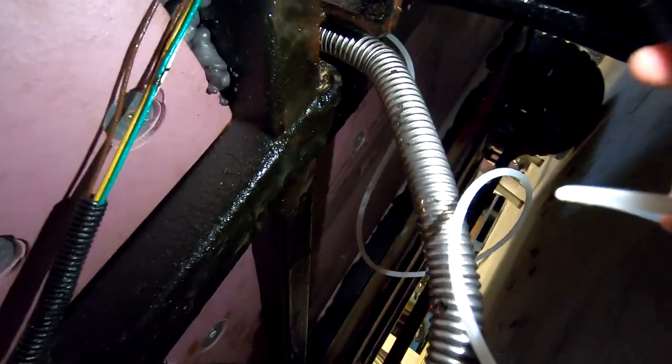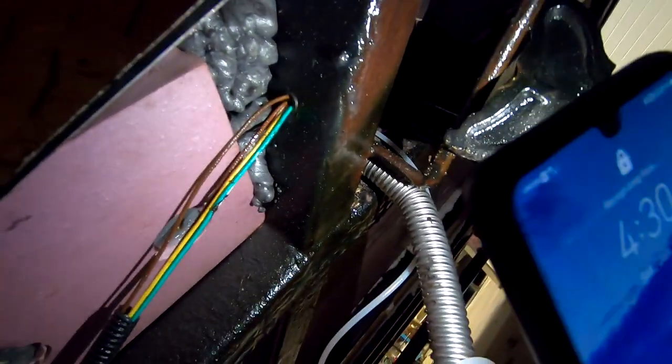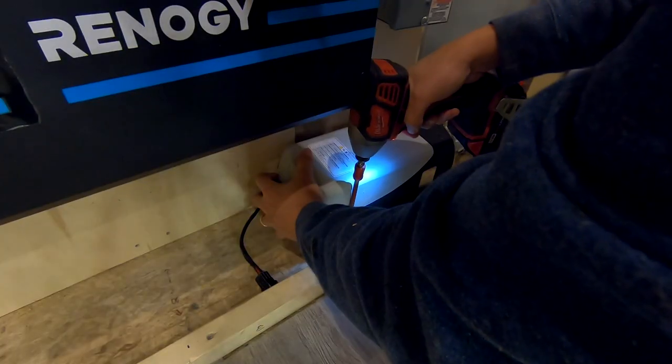Nice in there, and so the exhaust is gonna come out to the left, the air inlet's gonna go to the right, and the fuel line's gonna go to the front here where the fuel tank's gonna be mounted. So I'm gonna secure the diesel heater to the floor now, then I can work on the plumbing and electrical, I guess. So, yeah.